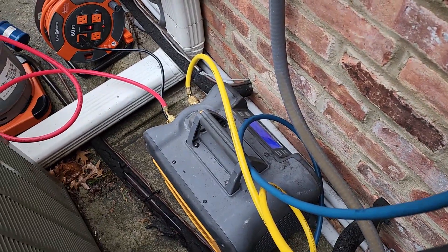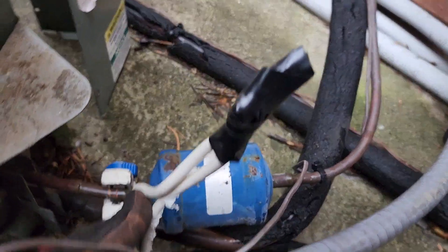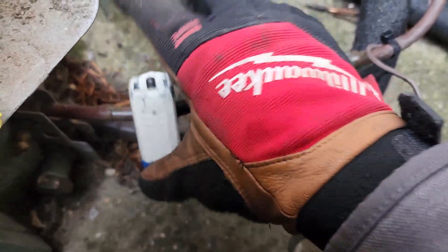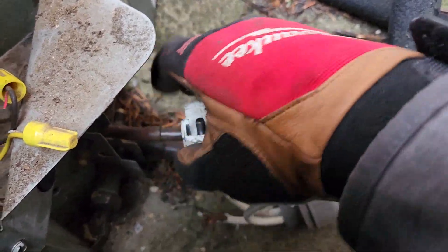It's coming down almost to zero. This will pull close to a vacuum, then it'll stop and shut off. Then I'll close everything up — close the ports, disconnect the line sets, and carry this one out too. I got the electrical disconnected, and I didn't have wire nuts for wire this size, so I individually wrapped them and then wrapped them with electrical tape. The disconnect is in the off position regardless, but just to keep water from getting in.